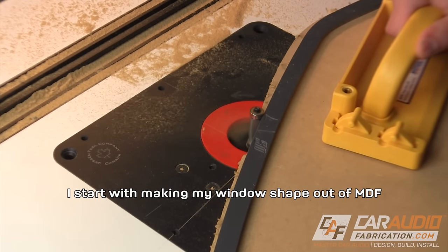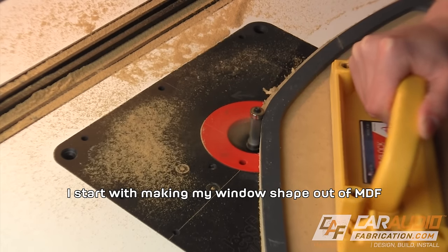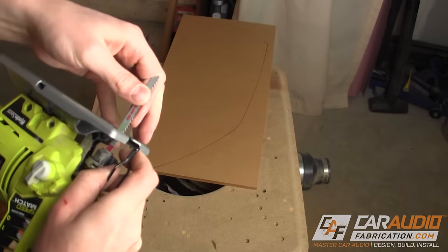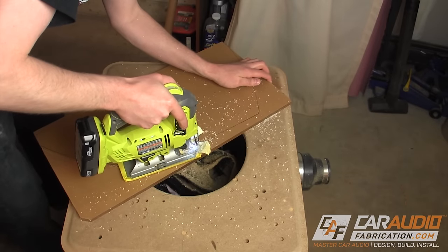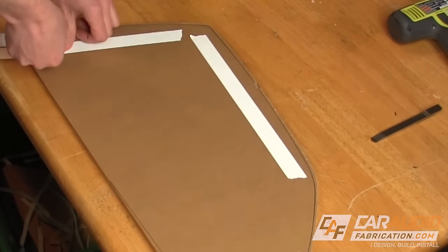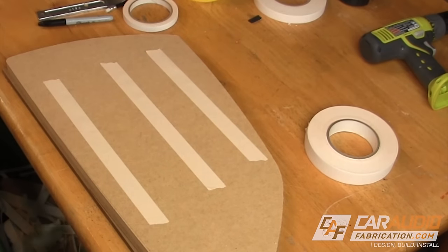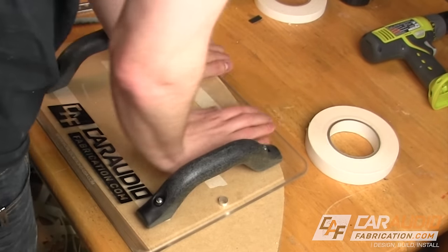I do want to point out that cutting acrylic on the router is dangerous. To keep things safe, I'm going to first copy my shape to a piece of three-quarter-inch MDF — you will see why in a second. Since this MDF shape will be my template for shaping the acrylic, I copy it to the acrylic. Now it is time to rough cut. For this, I'll be using a jigsaw with the proper blade for cutting acrylic — picking the right blade is extremely important. Links to this tool and all the others used in this video are available down in the video description. Now that my acrylic piece is cut roughly to size, I need to stick my wood template to it using beefy one-inch template tape, as we definitely do not want the acrylic to shift during the router cutting process. For safety, I'm also sticking my router safety shield to the wood template, which gives me precise control and always keeps my hands a safe distance from the blade.